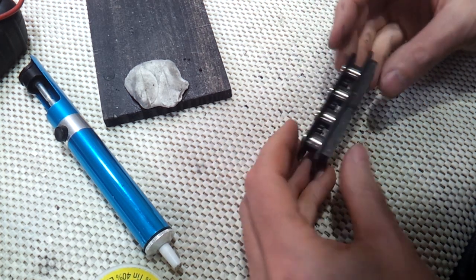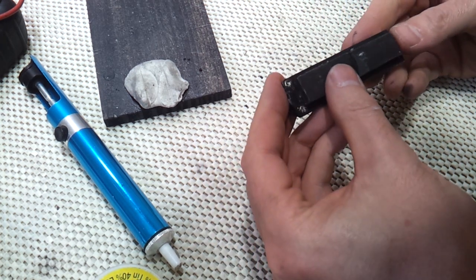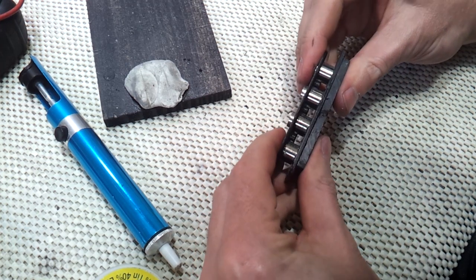Make sure you glue the magnets so one coil is north and the other is south. I just use a little compass from a camping store to keep tabs on this.